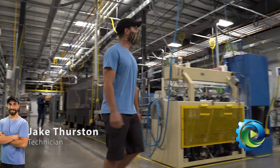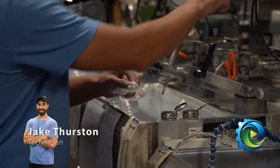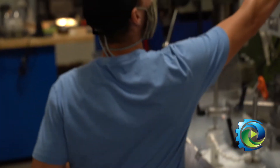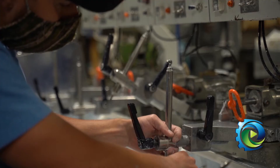The third step in the process is polishing and we're going to talk to our friend Jake. Polishing is the process where you take rouge — a very thin, milky, watery substance — and you put the glass lens in a machine where the rouge flows over it, and you use a pitch lap that rubs on and across the surface.